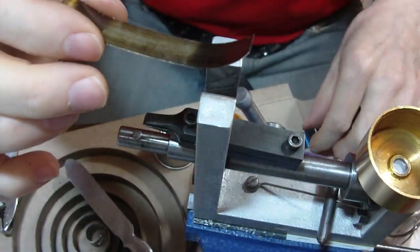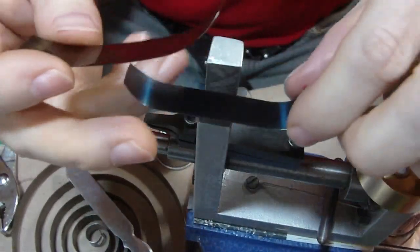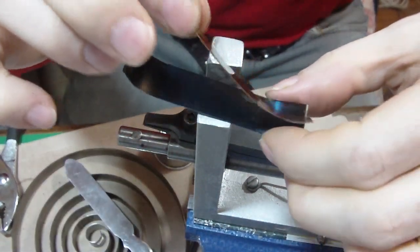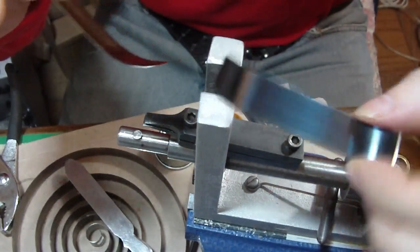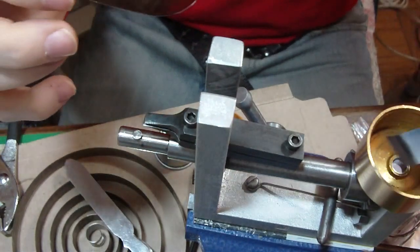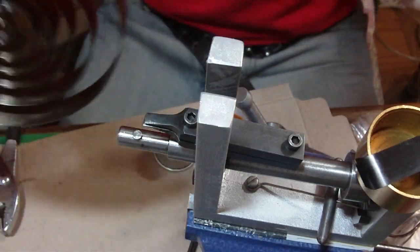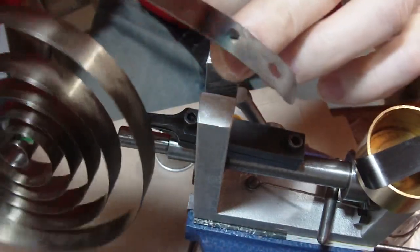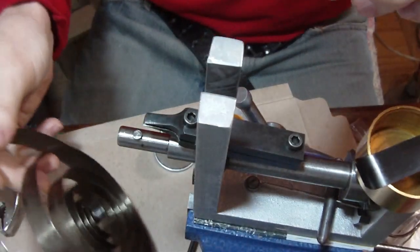When I bought the mainspring, I was given another brace, and they modified this one. Because on this brace, the chamfers are on opposite sides. This one's angled over here, facing you, and this one's angled not facing away from you. You can't see that, but it's angled both the same way. It's not going to catch on the rivet on the mainspring. That pin has an angle on it and it's supposed to catch onto the brace, and this brace is not going to do it.